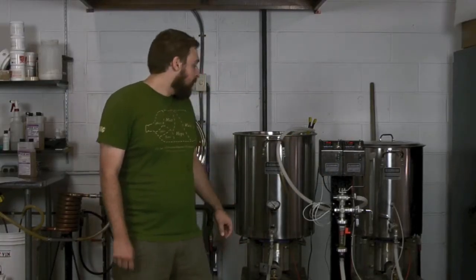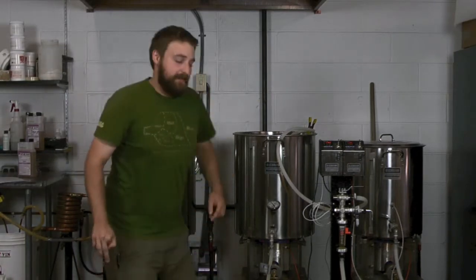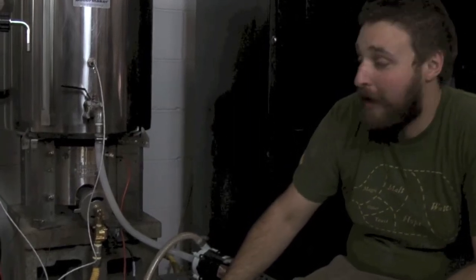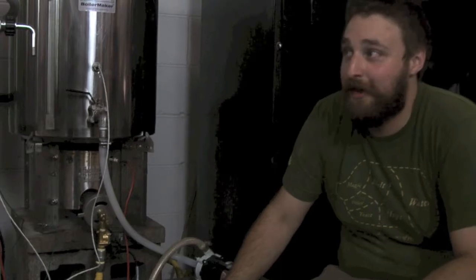Connected to the PID controllers are temperature probes going to both the mash tun and the hot liquor tank. We have gas solenoids that the tower is automatically activating when it needs to fire the burners to maintain our temperatures. As the tower unit needs to fire the burners on and off, it will automatically start the flow of gas, and there's an electric igniter right here that this orange wire is attached to. The piezoelectric igniter will spark the burner, and it will also sense to make sure that there is a flame. If no flame is detected for 8 to 10 seconds, it will automatically cut your flow of gas as a safety feature.